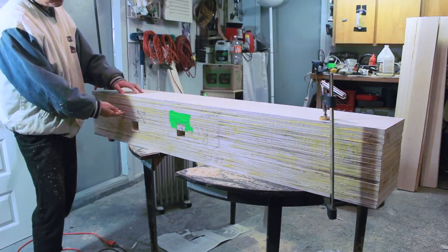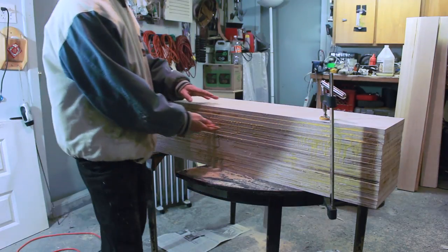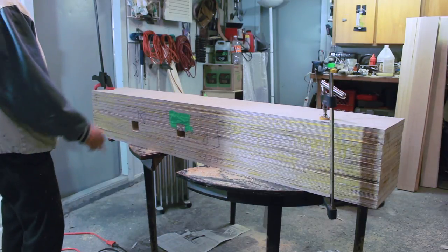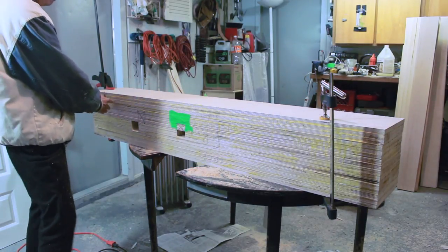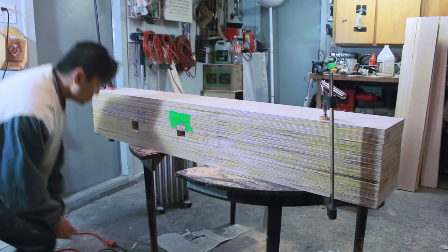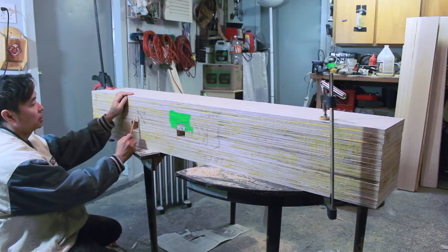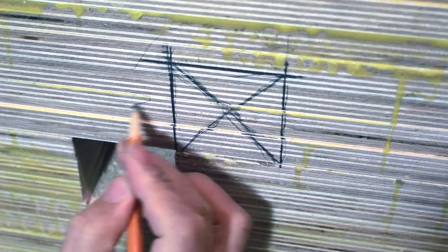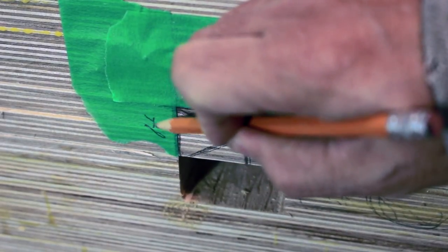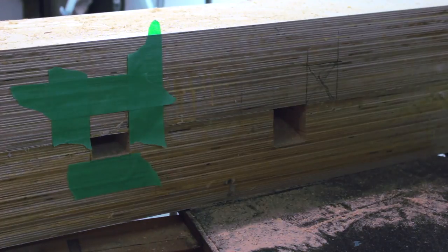I slapped on the top piece of the other side of the dummy. I finished the left side and now I'm going to do the right side. I'm not even going to measure how far from the top down — I'm just going to match the holes. Starting at this point right here, I'm going to match the hole and draw a two-inch by two-inch, and then here I'm going to match the center hole and draw a one and one-eighth by two-inch hole, as well as on the other side.